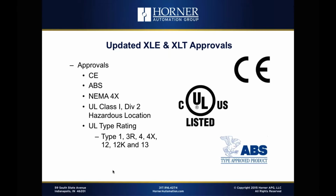These products carry the full UL Class 1 Div 2 hazardous location rating that they've always carried, as well as the UL type rating for environment, including type 1, 3R, 4, 4X, 12, 12K, and 13. So again, all those ratings are on the product without disruption.